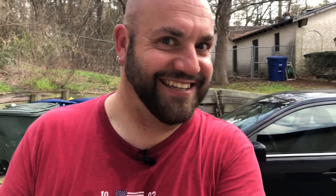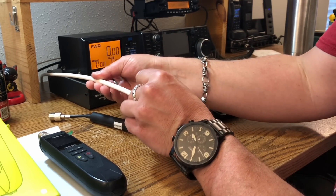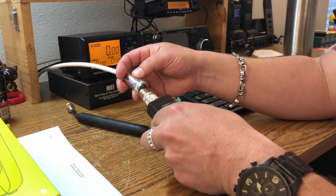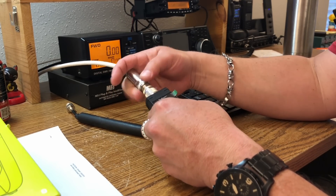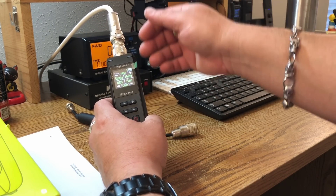It really doesn't matter that much when a wire is this long - six inches plus or minus. I've already looked at it on the analyzer. This is gonna sound weird for some of you: I'm not searching for the perfect resonant antenna, I'm not gonna chase it. What we're looking for right now is good enough. I'm using an inline choke but to show you the results we're just going to raw dog it - no cutting, no trimming of the wire. Something just worked, so we're going to go to these ham bands and show the graph.